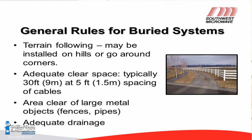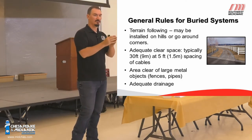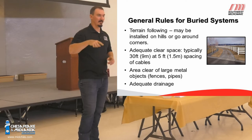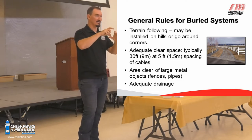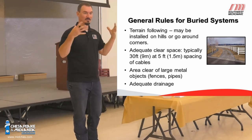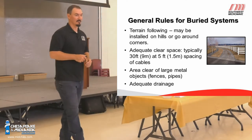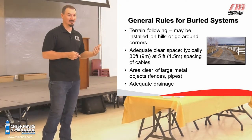When dealing with RF, any metal that touches other metal within that RF field will be a make-or-break connection. As it heats up, that might move. Think about chain link fence — it's a wire zigzagged all the way down, wires connected all the way up and down. Every point on every one of those diamonds where those touch is a make-or-break connection. As it heats up and expands, or cools and contracts, they move around. Every one of those can be a point of nuisance alarm. Every place you have metal touching metal can be a source for nuisance issues.